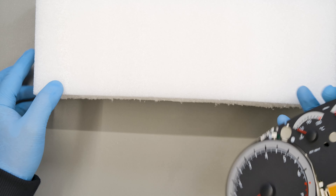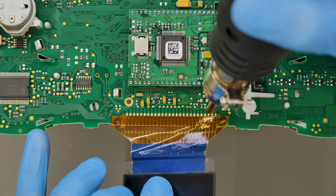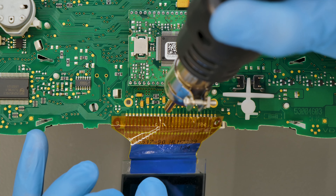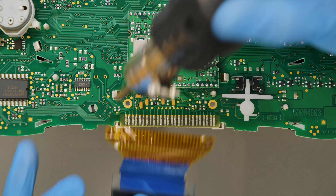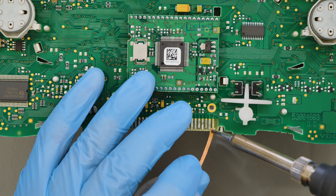Position the dashboard so as not to damage the display, and desolder the FPC using a hot air desoldering station. Remove the residual solder using the desoldering braid and clean with solvent.